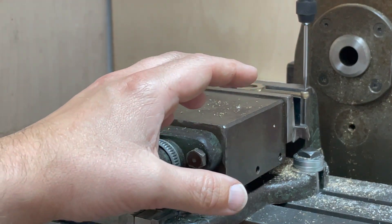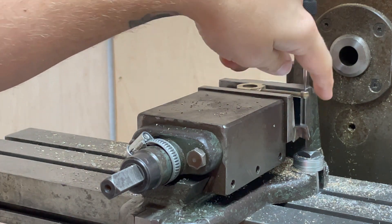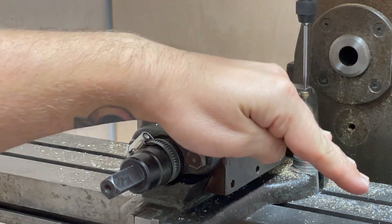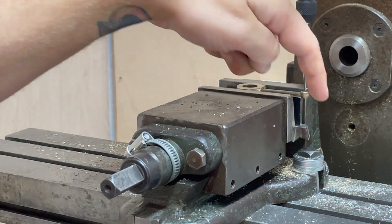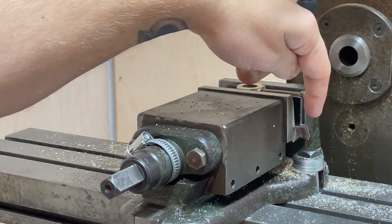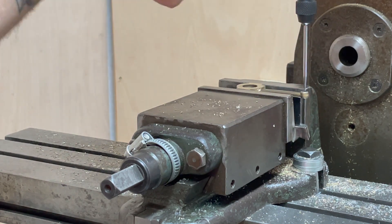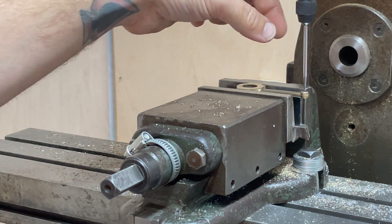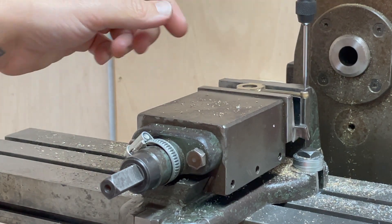In terms of process that worked great. What happened is the outside of this isn't perfectly vertical, so because of the draft in the casting I was off-centre anyway — even though I was exactly the right distance away from the sides, that didn't put me exactly in the centre. So I just nudged it a little by eye, and now I'm going to drill this.